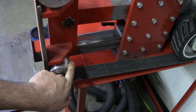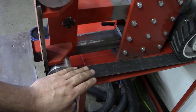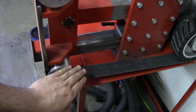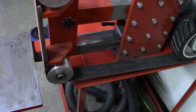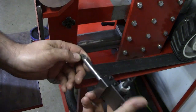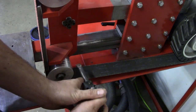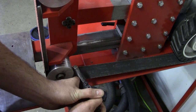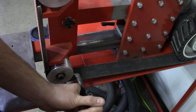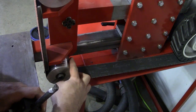What you can do is taper the wheel while it's running. Now, this is very dangerous — I want to say that very loud and very clear. Do not injure yourself; if you don't believe you can do this safely, please do not try. This is a boring tool for a lathe with a carbide tip. I turned on the belt grinder and held it just like this, dragging it across back and forth by hand.